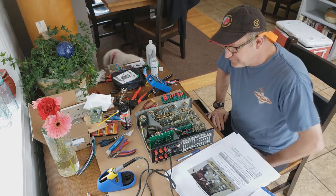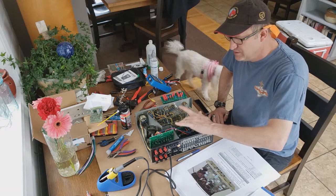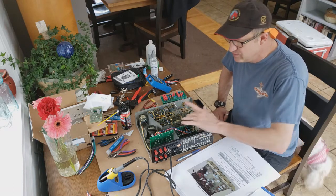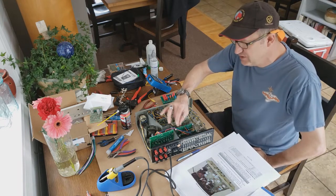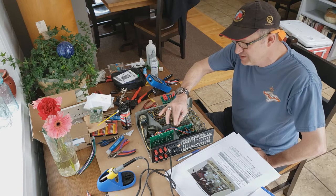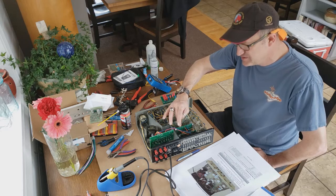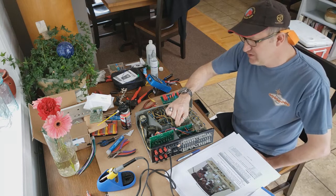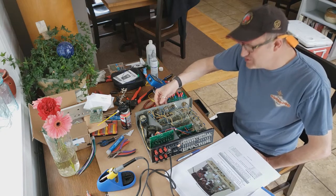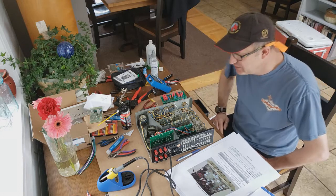So basically you have some different settings, and you have to read the manual, and you can try it out for a different gain setting, like this one here. This pot here does different gain settings, so the far end would be 0 dB gain, 3 dB, and then 6, and then 9. And that would actually set the volume, how much your volume is stepping up, so your volume ladder basically.